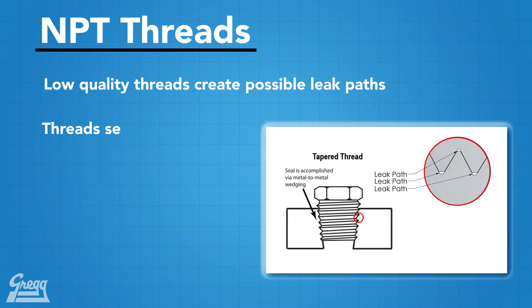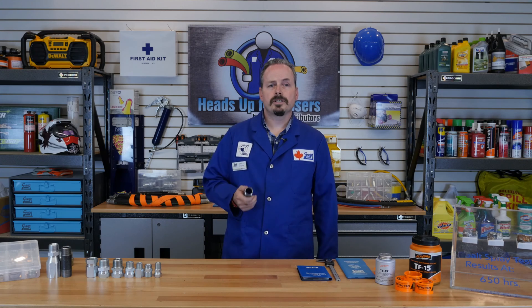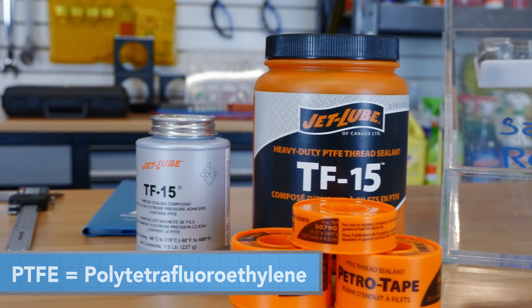Because of this wedge design, these fittings were never intended to be a connection that would be taken apart on a regular basis. Each time the connection is put back together, the wedge must be driven deeper to create a seal. Soon, there is no wedge left due to wear. To gain a proper seal in NPT fittings, you need a sealant compound or PTFE — poly, tetra, whatever the heck that is. This is because of the gap created by the lower quality tapered threads.